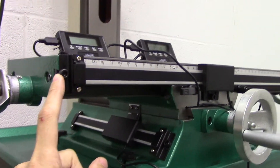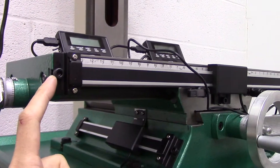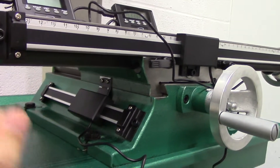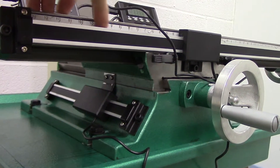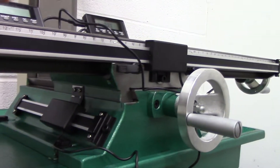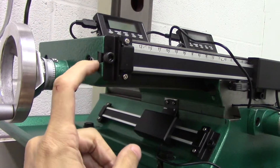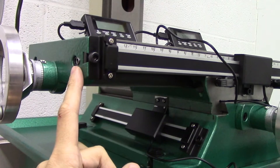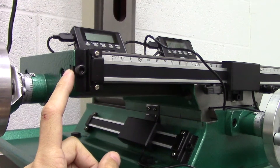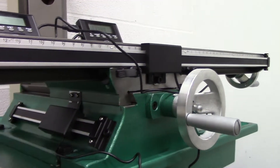These two bolts — there's a bolt on this side and a bolt on the other side — and they have these little slots. These slots travel along the table and are used as stops for the table. If you wanted to have a stop and didn't want to go a certain distance, you could just make the table stop. There used to be a piece of metal here that would stop when you put the bolt in the track. I moved it all the way to the end of the table — I got that idea from a couple of pictures on the internet. I did this on the other side as well, and the track is now perfectly aligned all the way across.